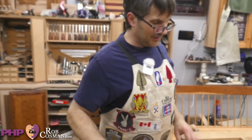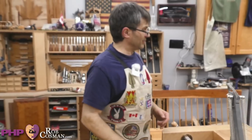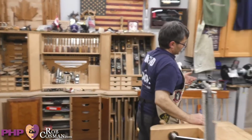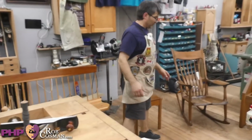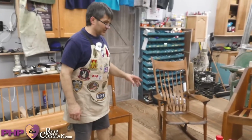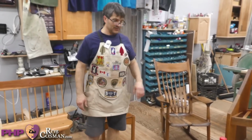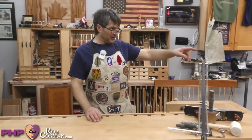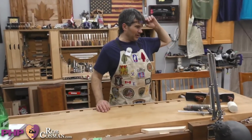You're just having to plane the middle one as the last one, to get rid of the saw marks. Bend that around the form, and then the final shaping is, this one was done mostly on a bandsaw, a lot of the shaping, but the final shaping was done with spokeshaves, rasps, draw knives. So no problem. In fact, those Windsor chairs are done almost entirely that way.